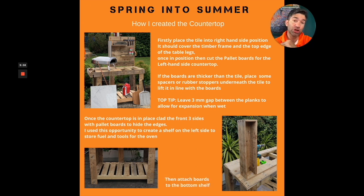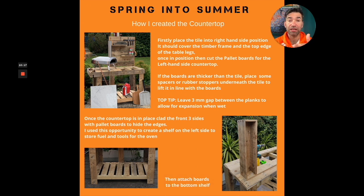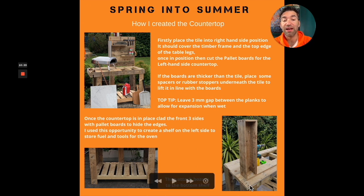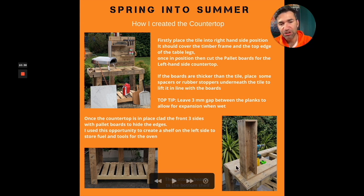What's interesting is it's been raining quite a lot and all of these timbers have expanded as timber does in the weather — it expands and contracts — and it started to buckle. I realized I hadn't given myself a little expansion gap, so recently I had to unscrew all of these and re-screw them down again, giving myself about a 3-4mm gap between each one. That allows the wood to expand and contract. So don't do what I did — give them some space between them.